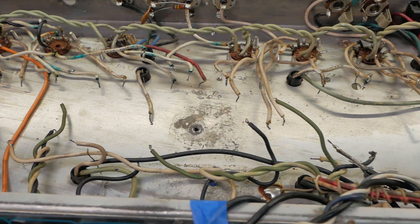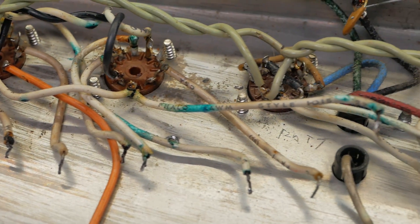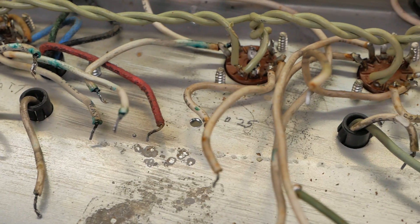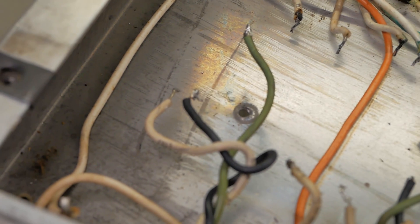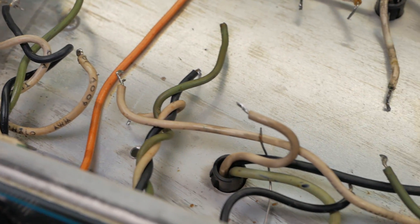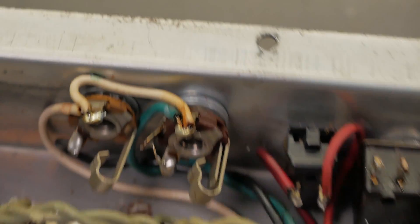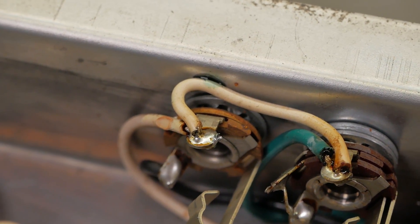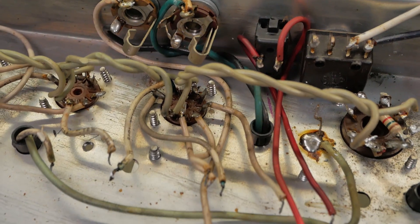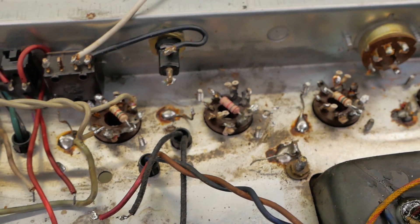Alright champions, I've cleared off most of what I want taken out - all the boards and some of the wiring with that green goo, which I'm going to replace as well. It seems to be only the white wire insulation that's affected. The other colour-coded wiring doesn't show evidence unless it's from a white one connected to the same terminal. You can see it on the speaker wire - it's literally seeping out and wicking up via capillary action, sticking to the chassis.